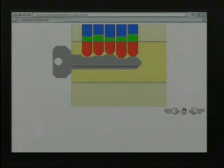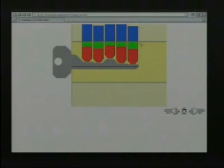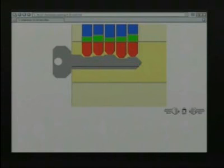You can freak a locksmith out if you know that and you're not supposed to, but locksmiths are real guarded with a lot of this info. We get dirty looks sometimes for being up here. So yeah, the change key, the user's key, is just pinned out like this, versus a master key, or the top master key, which is mastered for the whole building. It's pinned out like this, so that everywhere in the building, the combination of master pins and bottom pins all work out. Well, there's a very interesting attack that you can leverage against these locks that can let you turn your change key into a master key.